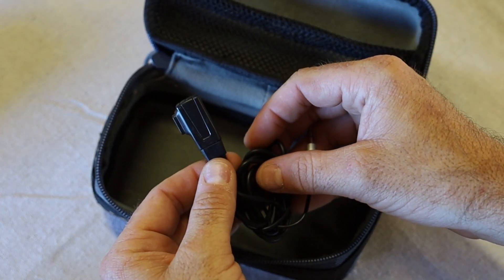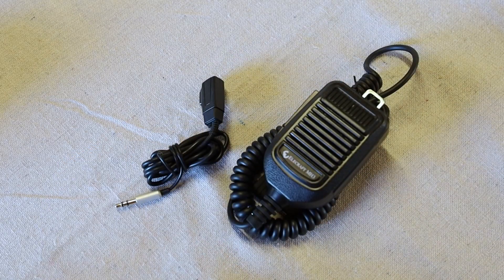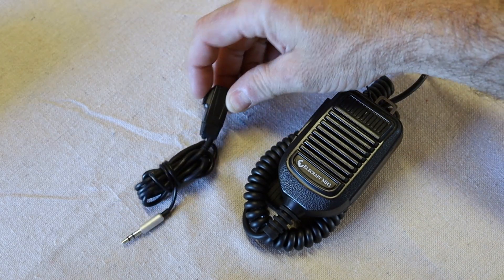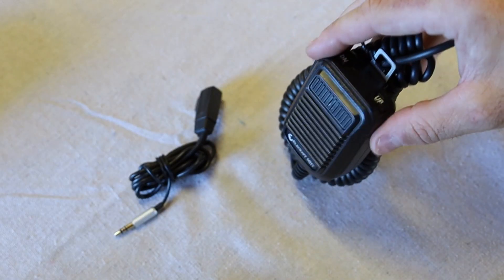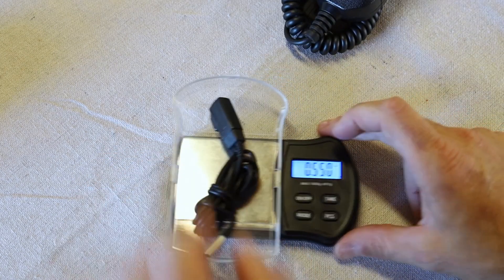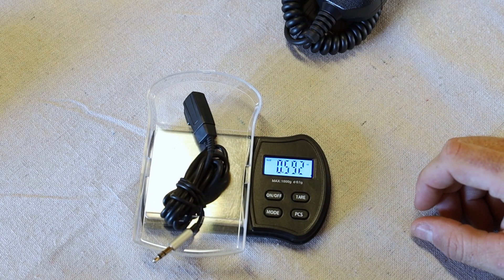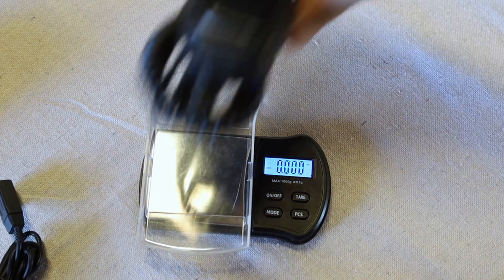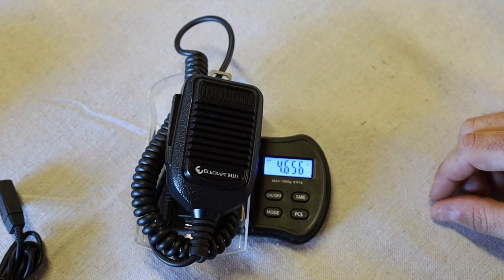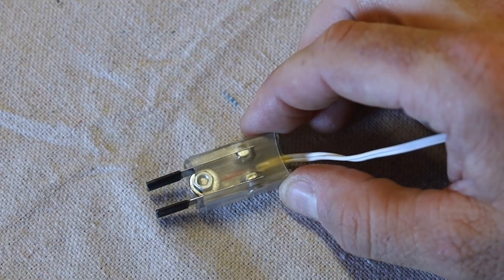For comparison, let's look at this little microphone versus the standard KX2 microphone. I've got the standard KX2 microphone on the right and the miniature microphone on the left. PTT is on the side for the small one — you do lose the up and down controls from the KX2 mic, but that's a compromise I'm willing to make. The miniature microphone weighs 0.6 ounces and the KX2 microphone weighs 4.6 ounces — you save 4 ounces, or a quarter of a pound. A worthy compromise in my opinion.